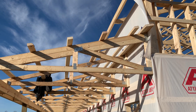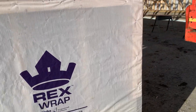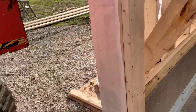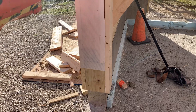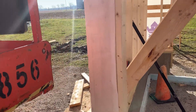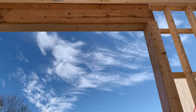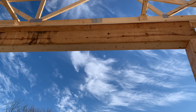I want to show you this existing footer right here — one foot — and this was done about five years ago. You can see what we had to do to keep it flush with the overhead door: we had to put a joining two by six right here to give it another inch and a half to make it flush with the door. You can see right up there two LVLs on the outside, and on the inside two by twelves.